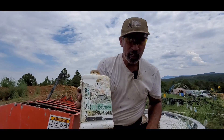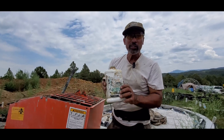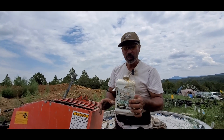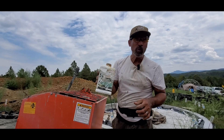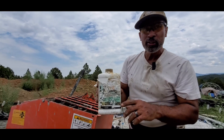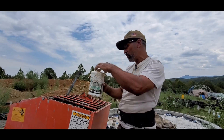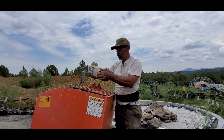This is an additive you can get from your local masonry store — it's for air entrainment. It's great to add to your cement slurry. Only about two ounces of this stuff you add to your cement slurry, and it'll help make your aircrete more consistent. It's good stuff to use. I'm sorry the label's not there — I'll see if I can find a label and put it in the description box.